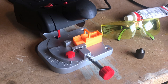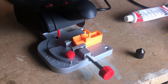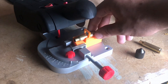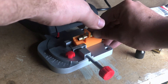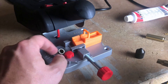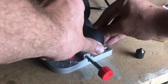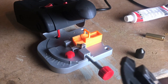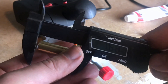Get your jig hooked up in your Harbor Freight chop saw. Remember to always wear your safety glasses. Position your brass in there. I always make sure to hold it to the back and not let it jiggle — there's a little cleat in there that should hold it in place, but a little extra pressure never hurt anybody. Let's make that cut. Your cut length should land you somewhere between 1.56 and 1.57 inches.